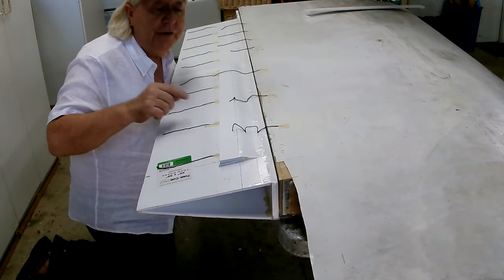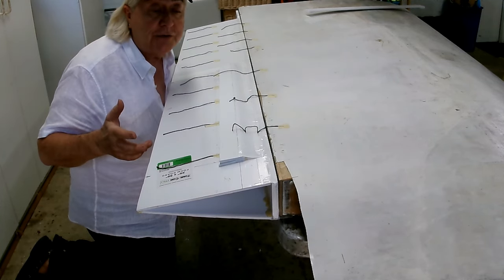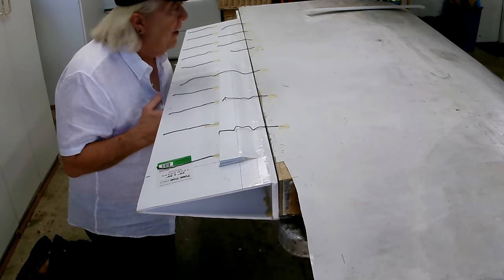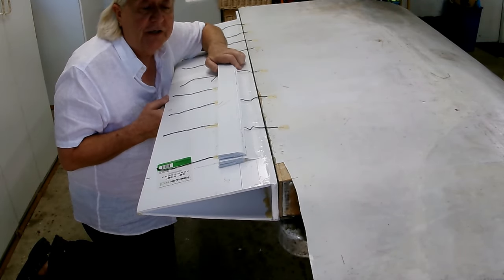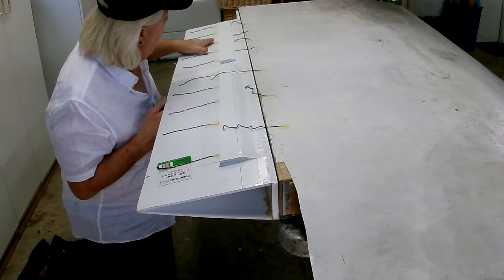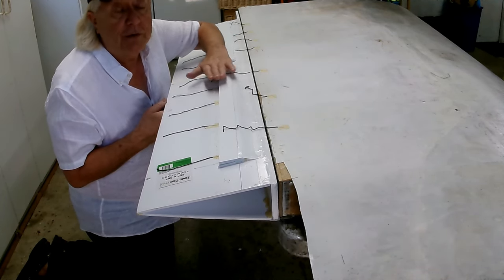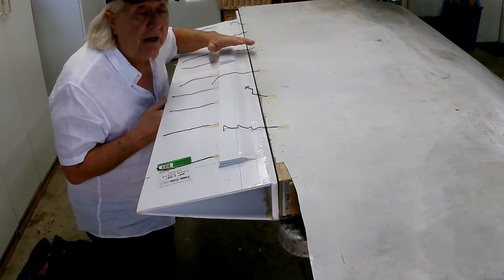One thing I could run into is that this ends up acting just like a big trip strip. We've tried a bunch of trip strips on the wing to no avail — some have helped a little bit, but nothing significant. So just in case, I made a duplicate cover that I can place over here. If the flow is well behaved with that solid cover, then we know this is kind of acting like a trip strip, as opposed to the lower-surface airflow actually helping the upper-surface flow. It's a way to differentiate cause and effect.